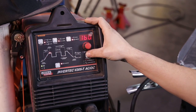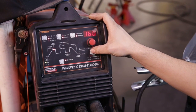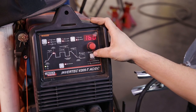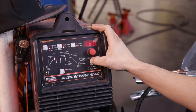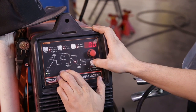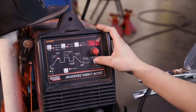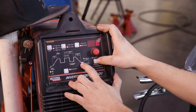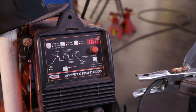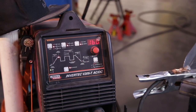It even lets you, if you don't feel like pulsing the pedal, weld without pulsing the pedal — it lets you dip and travel forward very nicely without keyholing your materials. Background current I have set at 30; if you go down lower to around 25 your weld becomes a little harder to travel, not quite as smooth, so I like to stay around 30. Down slope time is set to zero — I usually roll off the pedal — and finish current is usually just five to ten amps for a clean finish. Post flow kind of depends on your nozzle setup and how many amps you're using. I have it set at nine because it's fairly thin metal, so heat soaks really fast, and I have a pretty big cup, so I like real good smooth coverage at the end to keep everything shielded until it rolls off.